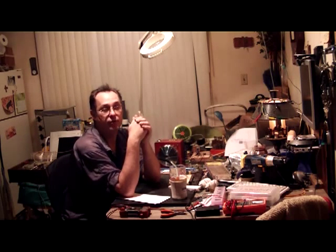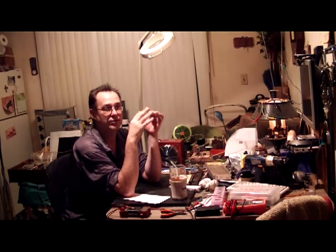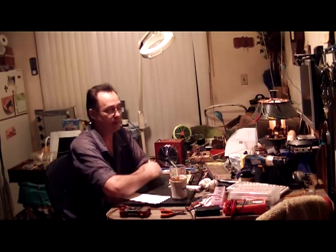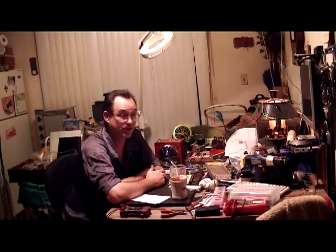I got the nebulizer pump at Goodwill for $2.00. I made a light box out of two old speakers with a low-wattage lamp and put some plexiglass windows in it. That helps for getting around 90 degrees to dry the clear coat. Clear coat doesn't like temperature extremes over 100 degrees — you end up with funky results.